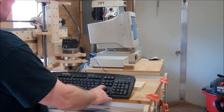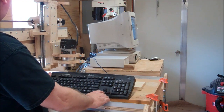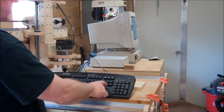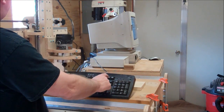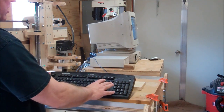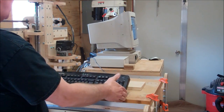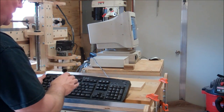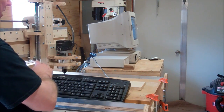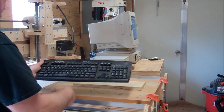If I push the up key, the Y-axis moves away from me. If I push the key pointing towards me, it comes back towards me. The Z-axis is easy: page up to make it go up, page down to make it go down. If you get your keys set up that way and position your computer so your keyboard is always on the side you're running your X-Y coordinates from, it really makes it easy so that you don't screw up.